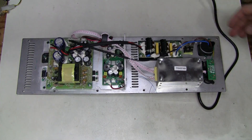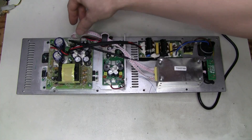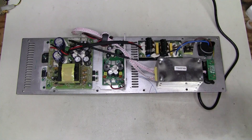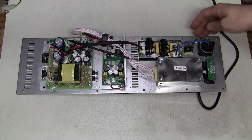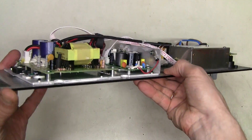So let's turn this thing off and start checking — let's see if the output of the power supply is shorted. We can try with disconnected load; this is the preamp and the power amp, so we can disconnect that and check for shorted transistors, diodes and such. I tried with disconnected load and it is still clicking. So I started checking for shorted components and I found something — let me zoom in and show you.